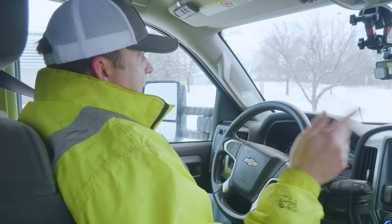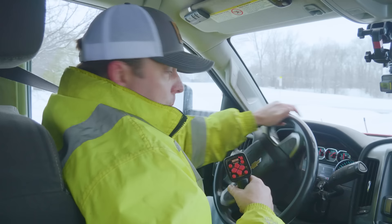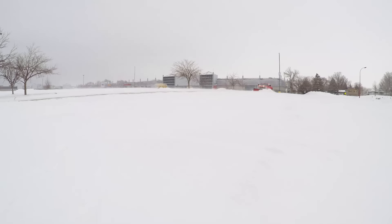I've already done it here where I've kind of cleaned out a spot. I initially go this direction where I'm going to be backing into for the windrow — I did about four passes here, whatever the width of that truck is. So you'll see I have an opening here. Now, the key to windrowing is knowing — and you won't know until the first or second pass depending on how much snow — in an ideal world you don't want anything to spill off on your outside. I'm going to the left here, so I want to try and keep material from going to the right. I'm making sure it's in float. Another big mistake I see is too many operators go fast right away — take it slow, take it easy.